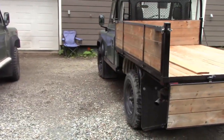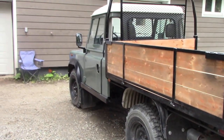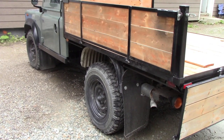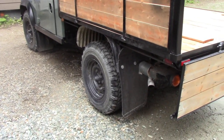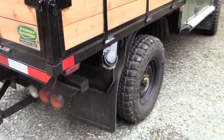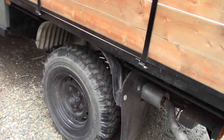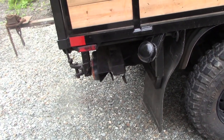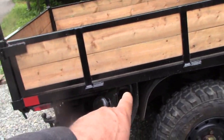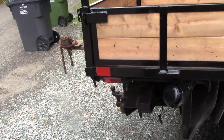I've done different designs - you can see the mud flap designs are kind of different. The exhaust is always a problem for placement. The window surrounds worked out quite well. The mud flaps are off a truck - on one I put them on backwards with the lip one way, on the other I used a piece of plastic block to space them out so they wouldn't rub the tyres. On Mark 2 I fastened them to the tube and ran it down - no dirt kicked up underneath.